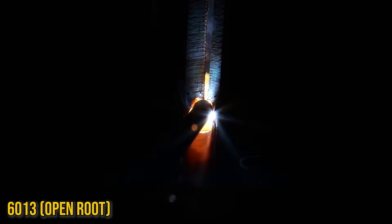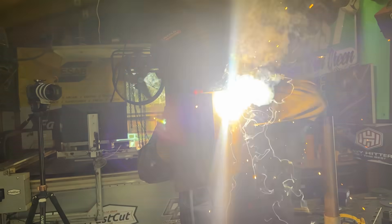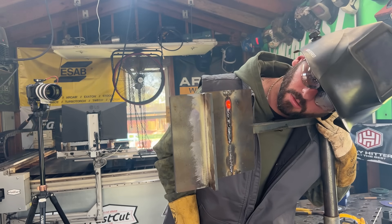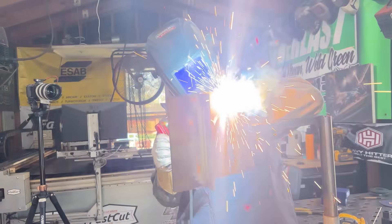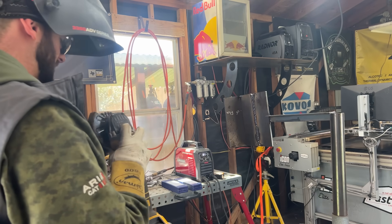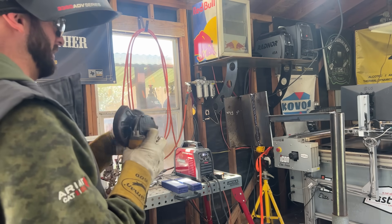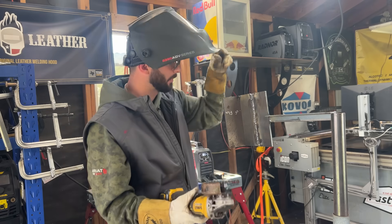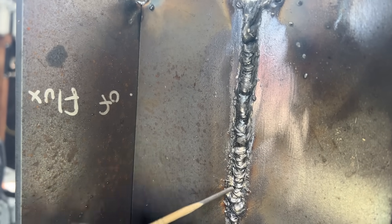Honestly, this is welding just fine too - kind of dripping in there, staying much higher up instead of on my puddle. Just kind of staying to the top side of the keyhole and just dripping in. Maybe the rod or something's getting hotter or I've got a rod angle issue - it's getting a little bit wide open now. There ain't no light going through it. Let's take a look. Give it a quick jimmy because the 6013 has a lot heavier slag and is probably a little lower than we think. If I'm being honest, I really don't like any of my 6011. I like the 6013 a lot more.